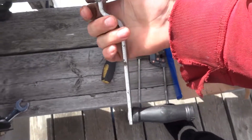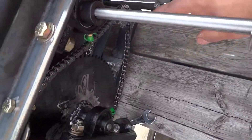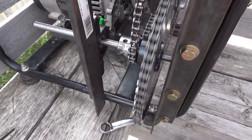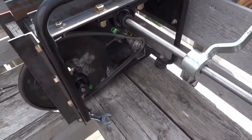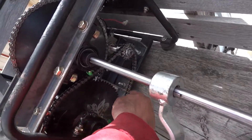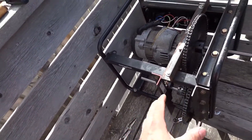Getting the threads in just so it gets in there — I've got to hold it with my one finger. I've got to go this way — nope, other way — mainly because this chain is still loose. That chain is on. So one-to-one, my hand in this thing — you see how it's turning, turning it faster. It's gonna start skipping. So I am going to put a tensioner right there. There are slots in this and I'm gonna slide it backwards — that'll tighten up the chain.